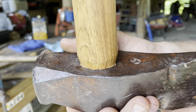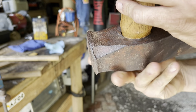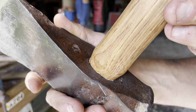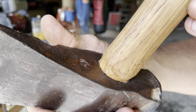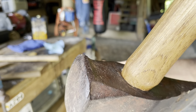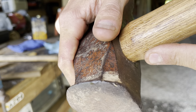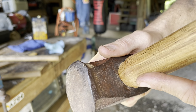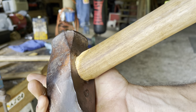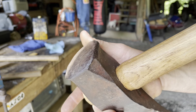What you're looking for are those curls — see those curls of wood? That's where the head of the maul is shaving the axe handle just a little bit as it seats on there really securely. What you want is for that to go all the way around; if you have it all the way around, you know you've got it seated really really well. I still have a small gap back here in the back, but I don't think that's going to cause too big of an issue. I think I'm just going to go for it, get a few more taps, try to get that to seat a little bit more, and then I think we'll be in business.